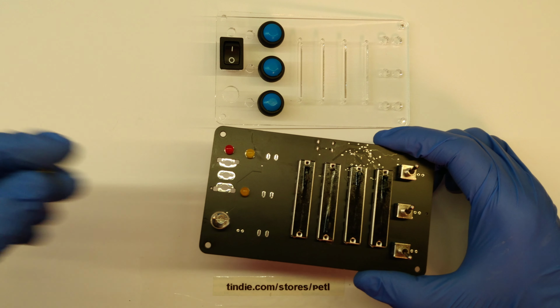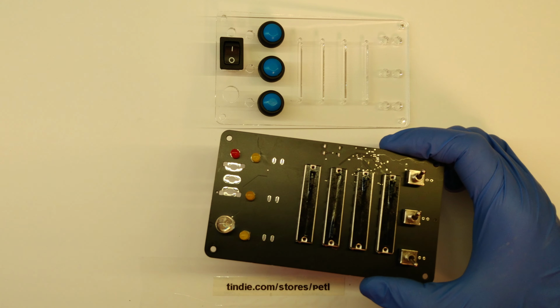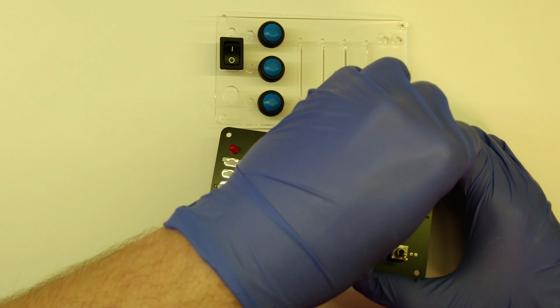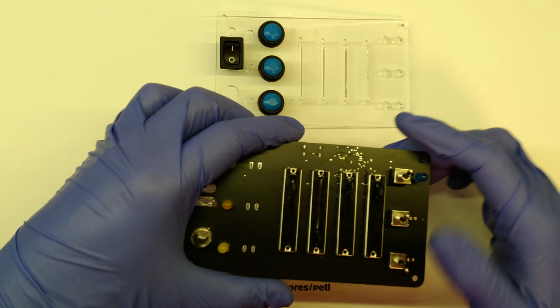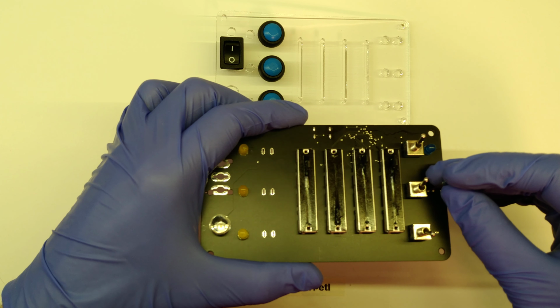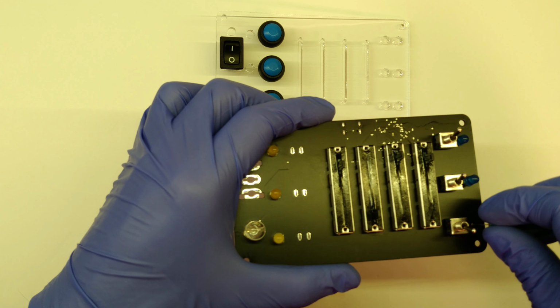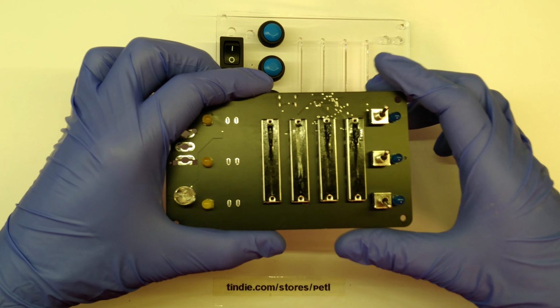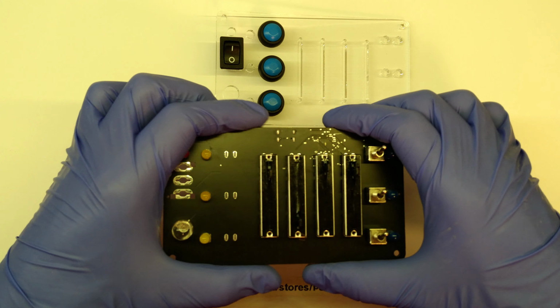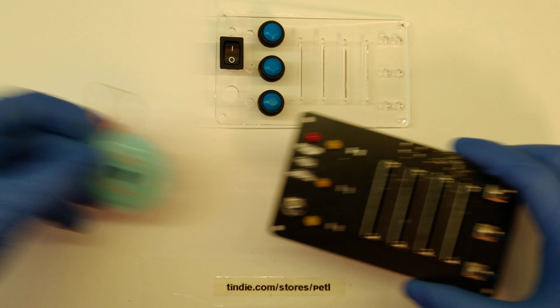So while putting in the LEDs, make sure that all the long leads are on the left hand side, because LEDs are directional, so the other parts actually don't matter that much or cannot be put in the wrong way around like the faders, but the LEDs can actually be put in the wrong way around, and they will not work if you do that. There are 2 debug LEDs on the back, which we are going to take a quick look at later. So in case you have put in the LEDs the wrong way around, you can actually still see if something is happening at all. Before putting it down, I'm going to underlay something so that the LEDs just don't pop out on their own. Give me a second here. Perfect.